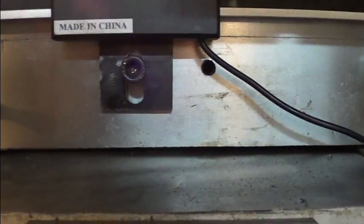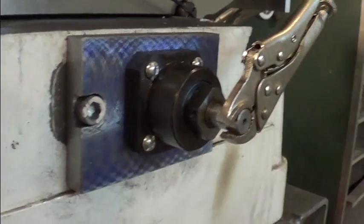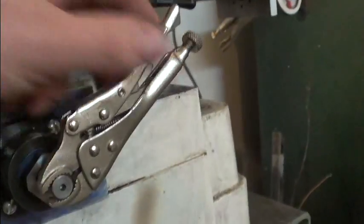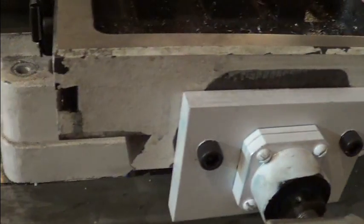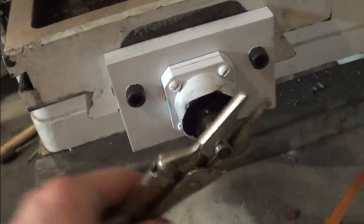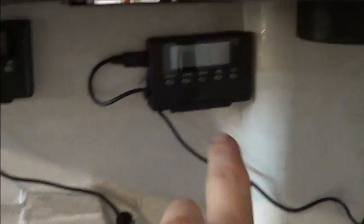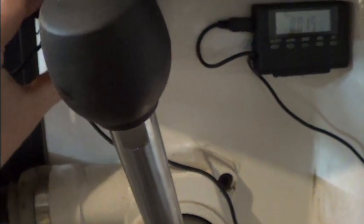This is where the stop bracket center bracket used to mount, so what I did was machine a quick groove on that. Still got to tighten that down. But this is the Y bearing plate — haven't painted it yet. My temporary handle works just so much smoother. And then the X-axis plate is painted with a temporary handle. These are where I got the DROs mounted — this is the Y and this is the X. They're self-contained with batteries and got magnets. They have a deal where you can mount the plate, so I'm probably going to make a bracket that hangs off the side so it's easier to see.